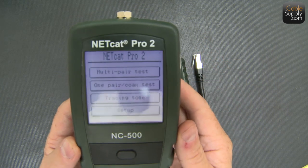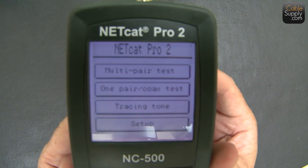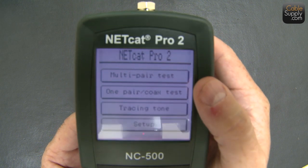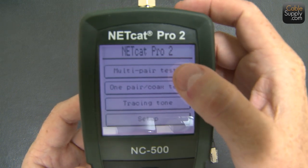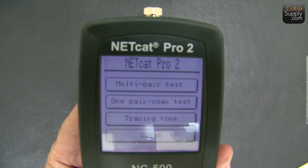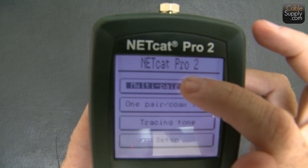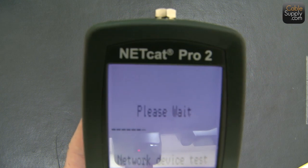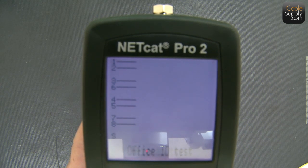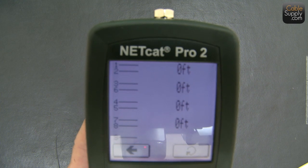Push this to go back. We do have a PDF on our website with instructions. The one-pair test I'm not even going to demonstrate — you just push it and it tells you whether it works. Here's the multi-pair tester — that's for your RJ45, which is 99% of the time what you'll be working with. I press and hold for two seconds, let go, and it comes up testing — and shows nothing is attached, all zero feet away.